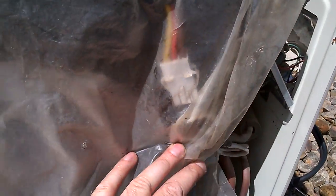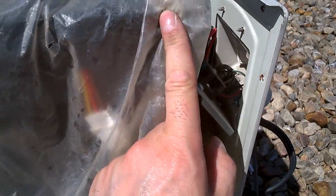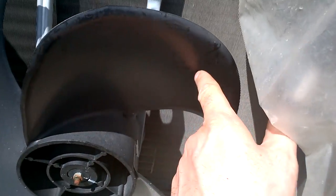I'm going to put a little plastic over it — just be careful not to touch any electrical connectors. The plastic goes underneath, close to the fan blades which throw the humidity over the unit. Don't touch any wires with the plastic; keep the plastic away and secure from the blade.